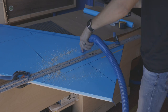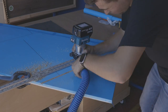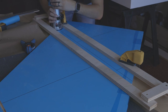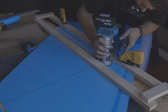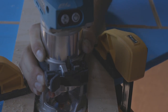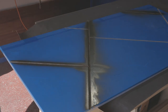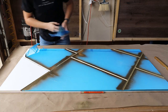Then I'm drawing the desired design pattern. Using a V-shape grooving router bit I'm cutting the groove. At first I was using an aluminum guide to make the groove, but it's hard to make a straight cut using just one edge support, so I made a double-sided guide jig to make the process easier. Once this part is done I painted the groove using gold spray paint — and this is why I had to apply masking film. It protected the painted surface so I was able to cut and paint the design cleanly.